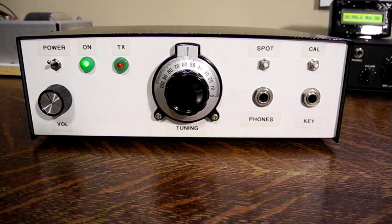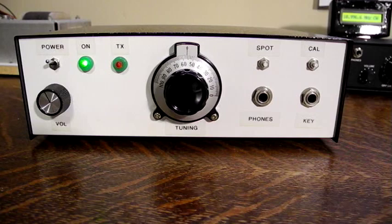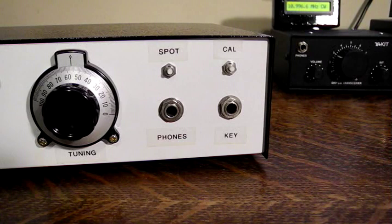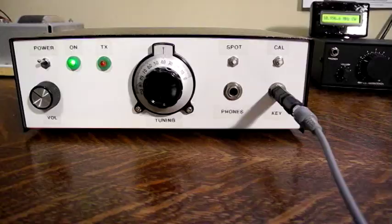Here it is set up for operation. On the rear panel we have simply an antenna connector and wires for the 12 volt DC power. The front panel controls include power, volume control, LEDs for power and transmit operation, and the main tuning knob. There are connectors for headphones and the code key. The cal button turns on the crystal calibrator, which in my case is a 7.04 megahertz crystal — you can use it to confirm that the tuning is where it is expected, in my case just about the center of the dial. During transmit, the VFO shifts by about 600 hertz from the receive frequency so that you hear a beat frequency. The spot switch shifts the VFO on receive so you can zero beat the radio against the signal being received.